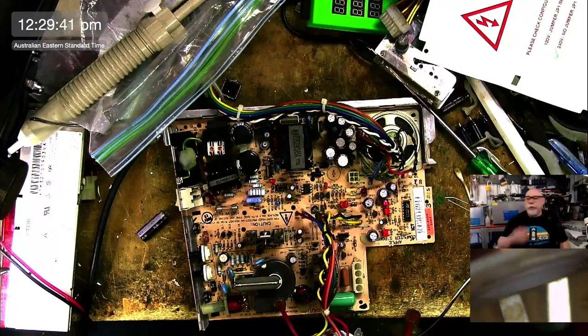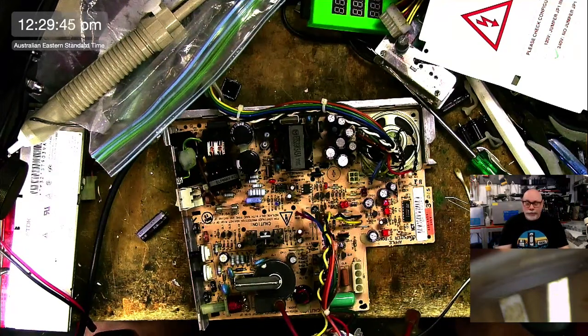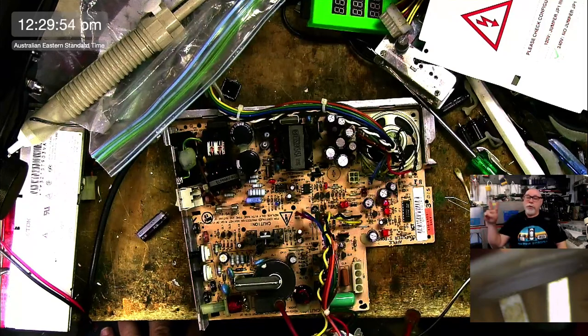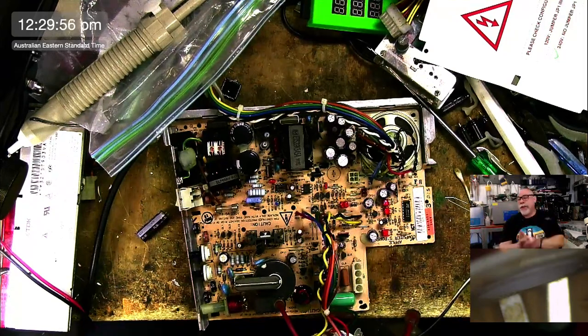I am going to actually do the whole process, and I'm going to have a bit of fun with the Quadra 840. Assuming I get it working. I mean, we can't just presume that I'm going to get it working. 840 AVs are a nightmare. There are two different types of board that you get for the Quadra 840 AV. There is a green one and a black one. And the green one, I think, is made in Ireland, and the black one is not made in Ireland. I don't remember where from. And the black one is typically a lot more difficult than the green one.